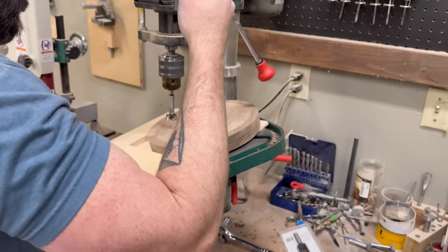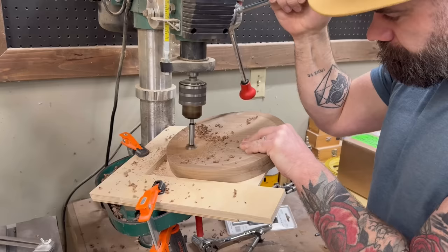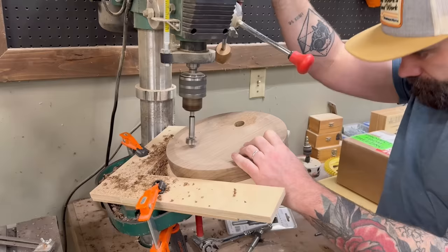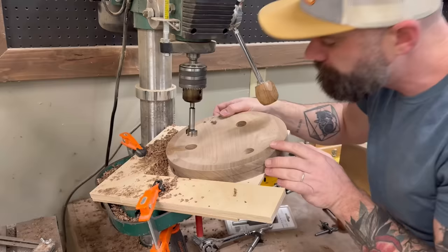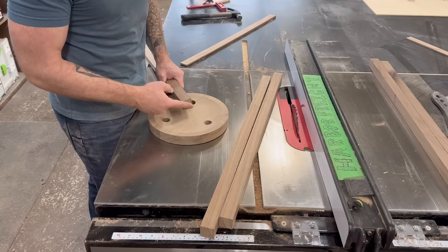I took my little equilateral triangle, set it on the top of my stool seat, measured out from each point to make sure it was perfectly centered, and marked each point — this is where I'll drill my holes for the through tenons. I went to my drill press, already set to my 14-degree angle, made a little plywood template to hold the seat top, and just started drilling, hoping I was doing this right because I've never made one of these stools before. As a wise man always said: when in doubt, drill it out — and that wise man was me, just now.